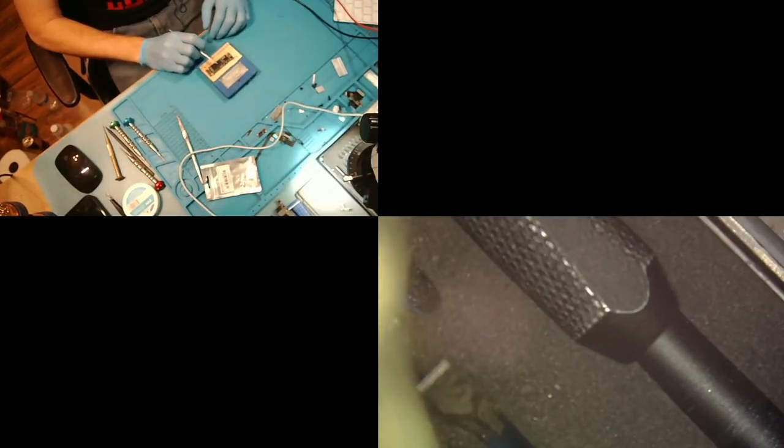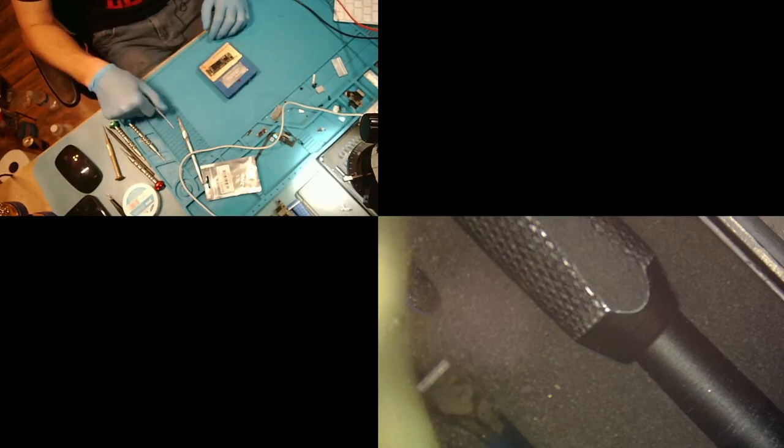Now what I do is I take one of the screws. I don't know if this one will work. I put it in one of the standoffs. Yeah, wrong, that screw's not gonna work. Pull one of these right here. All right, and I put it in one of the standoffs. I do that so when the board gets to temperature, I can just take my tweezers and pull on that screw and pull the top board off, right? It's very simple, very easy to do.